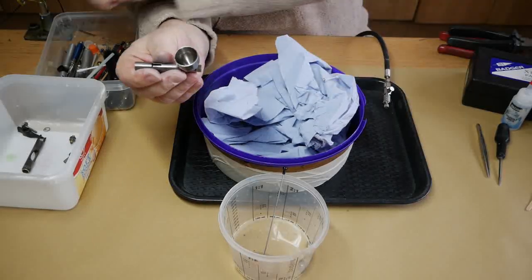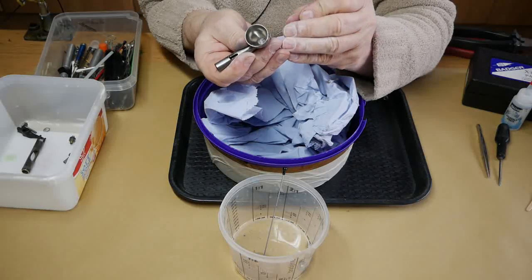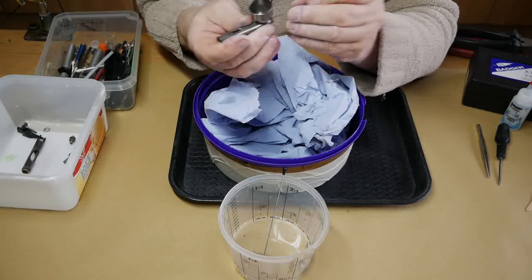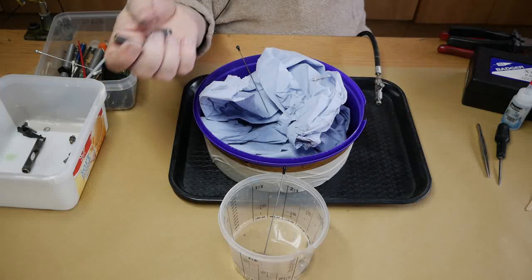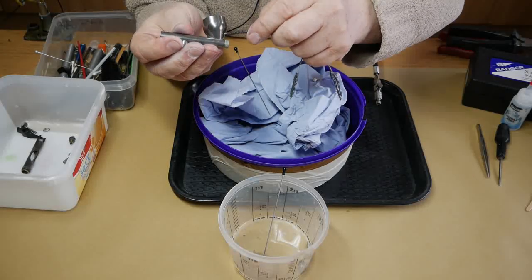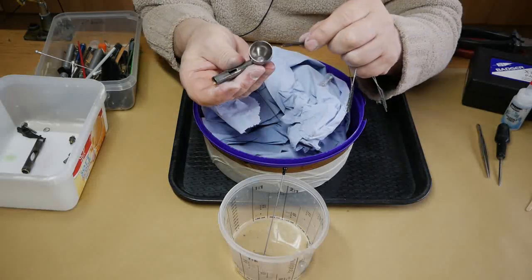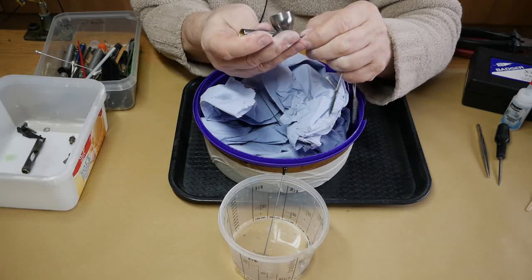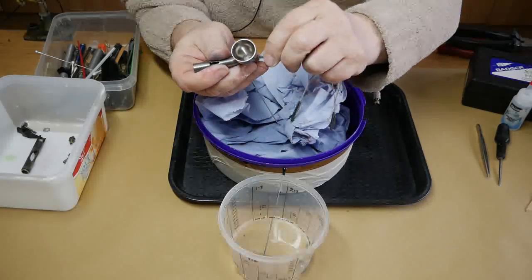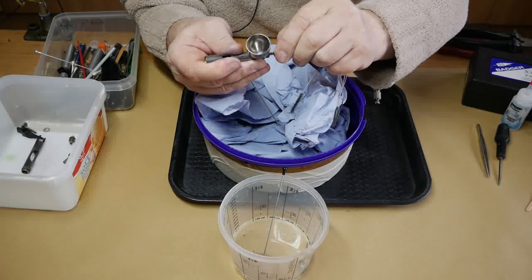Now I will get a needle that was bent some time back and got like a little hook on it, and just gently — I am not going in past any part of the airbrush, I'm just gently working it. Now there's a lot of controversy about these types of brushes because of the metal on them, and the thing is you cannot go past the halfway point in the color cup, because if you go past that there's a chance you can damage the needle bearing. But I do personally find these very good for getting debris out of the airbrush, but I never ever go past the halfway mark on the color cup at all.